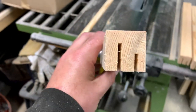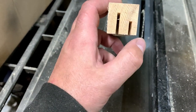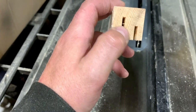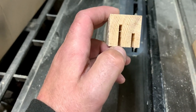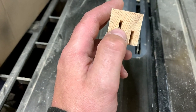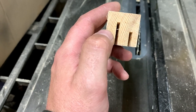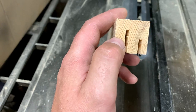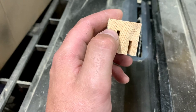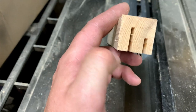What I've done so far is I've run this through the table saw at two different depths — this one is 15mm from the front with a 5mm inset, and this one is 25mm through with a 25mm inset. The plan now is to reset the circular saw so we cut this piece out through here, which will give me the seat for the glass to fit on. Then we'll set another depth on the circular saw and cut this final little piece out — that'll be our final depth and this will be our backing plate, so in the end you'll end up with a step.